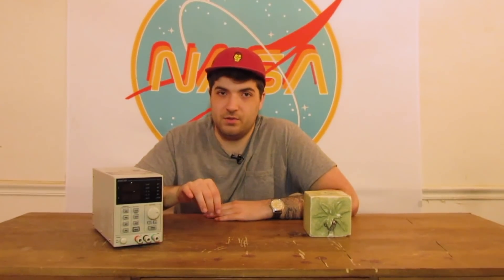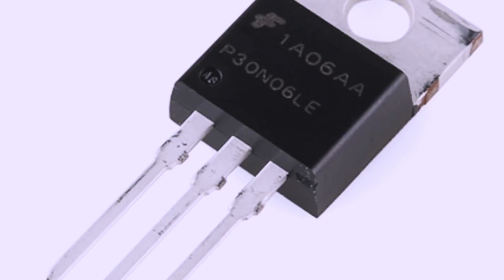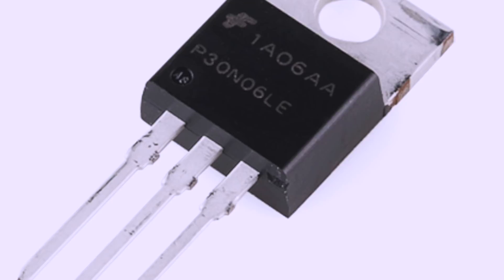Let's get into how this is all going to work. First things first: parts. For my microcontroller I'm going to be using an Arduino Uno, and I'll get into why I'm using a microcontroller a little bit later. I'll also be using a photoresistor, a laser module, a 9-volt battery, a one-channel MOSFET — which can be switched out with a BJT — a 100k resistor, and a buzzer. I need to design a circuit that is perfectly fine while the photoresistor is being hit with laser light, but gets angry and starts yelling when that laser line is broken. Whenever engineering something, you always have to highlight and deal with constraints.